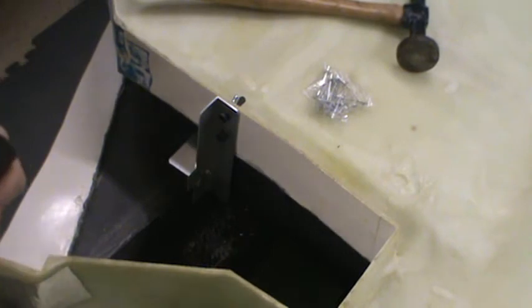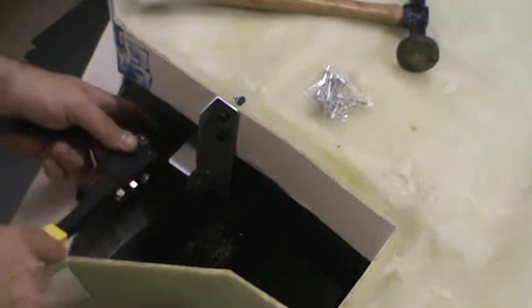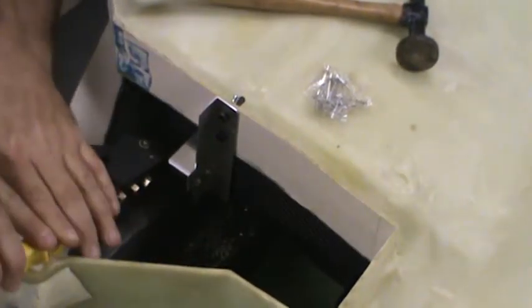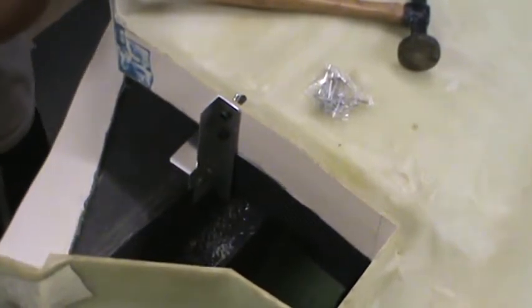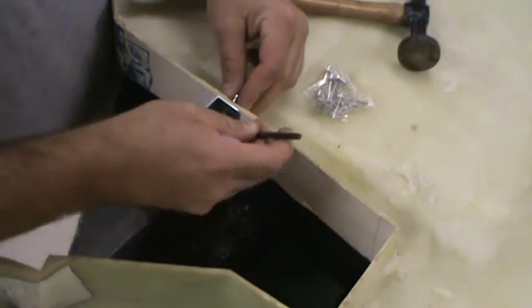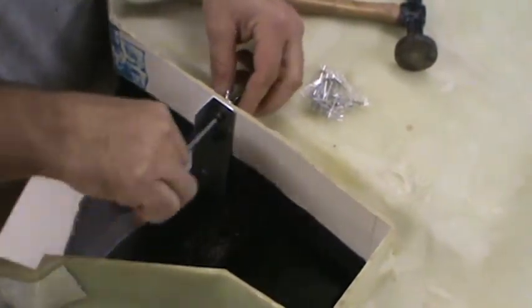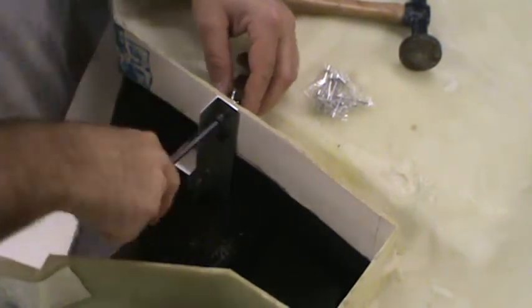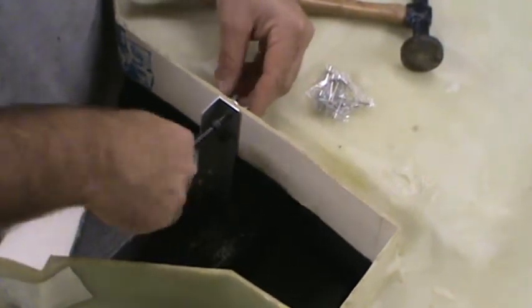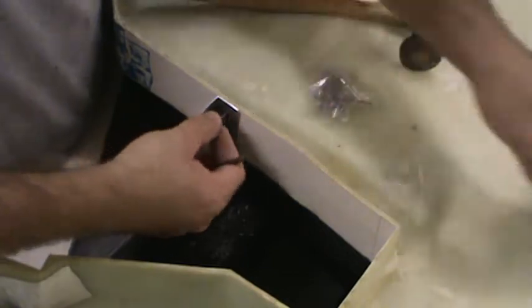Yes, I'm gonna do 4 holes per jig where they go together, if you haven't figured that out already. And no, I'm not deburring them, I should, but it's just an assembly fixture. Alright, now that that one's done, well, done other than one pop rivet, which I'll get with it out of the airplane, we can pull it back off and see if it actually worked. It should. It's staying there, right?